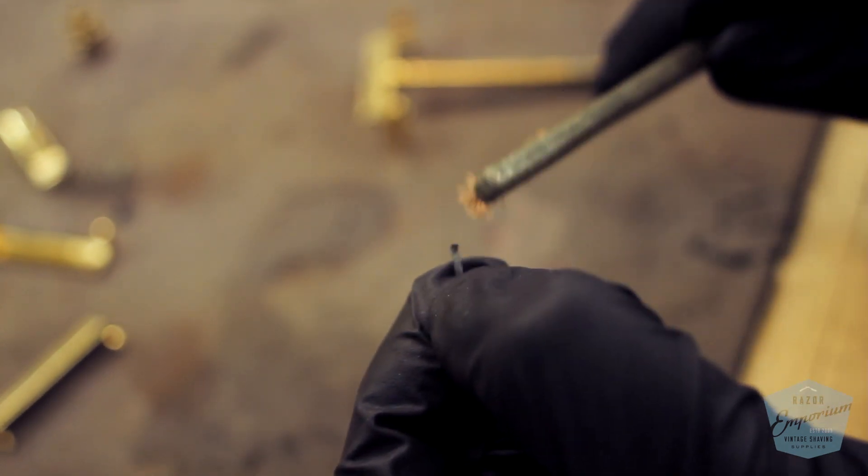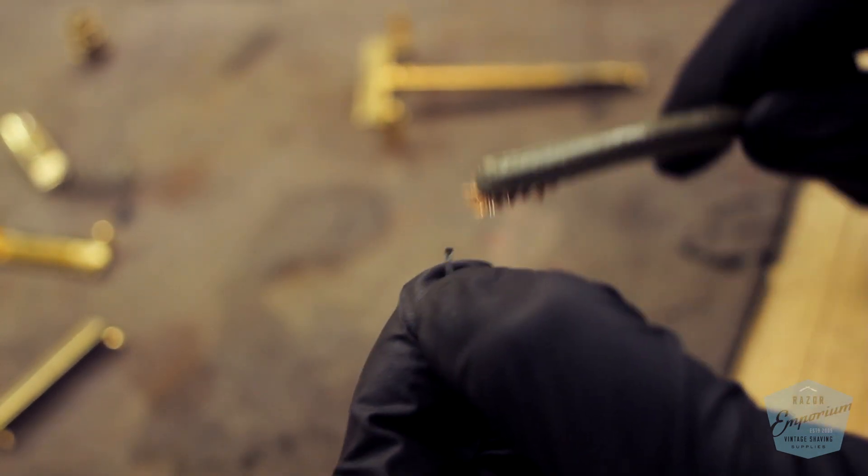Be very, very careful when handling these clickers — we clean them completely by hand with small wire brushes. They are fragile, usually spring steel, and they can snap or break. Also pay attention to orientation: the little side with an indentation is what goes into the guard assembly and towards the dial to make the clicking sound.